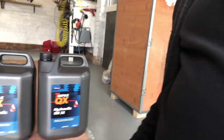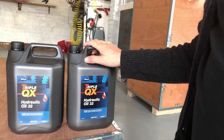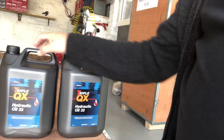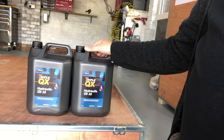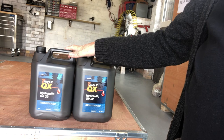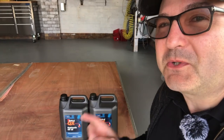One thing I was able to do while I was away: when you buy a lift, particularly in the UK — it might be different elsewhere — they may not be able to ship the hydraulic oil with it; that's just an insurance and licensing thing. So you need some ISO 32 hydraulic oil. For the lift I've got you need between 6 and 8 litres, so I've got 10 litres. It's not desperately cheap — I think I paid £60 for this decent quality oil. You can definitely buy cheaper, but it's just something to remember and allow for.